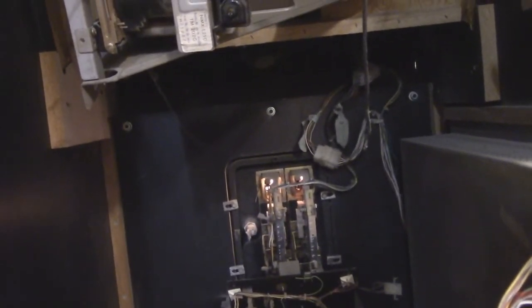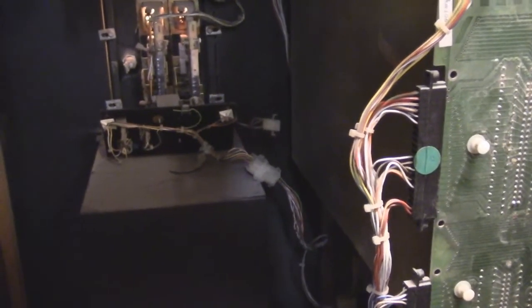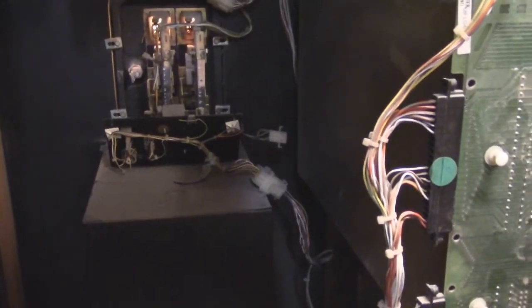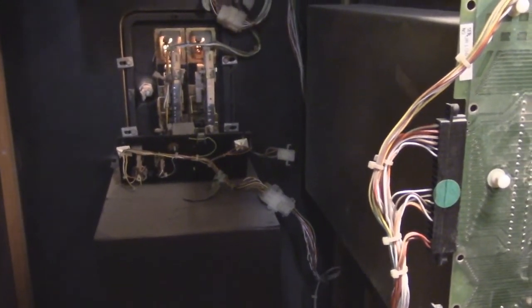We've got sound, we've got vertical collapse, lights are on. When you turn one of these games on, it goes through a self test. This self test checks all the RAM and everything. If it fails, you're going to see a screen of garbage as well as hear tones, because it's telling you what's wrong. And that's what we're listening to right now — we have to count those. It's 10 tones, then it repeats. That's basically telling me that one of the RAM chips is bad on the main board.